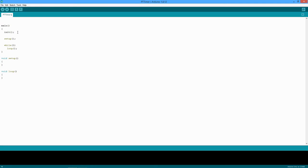Init are things that the system takes care of for you, for example, setting up the timers on the microcontroller. Setup is sort of your version of that. If you need to set a particular input port or output port, or set the direction of a bidirectional port, that's what you do in setup. It's a one-time thing at the beginning of the program.